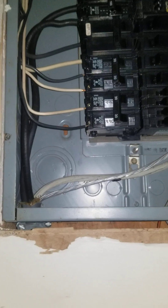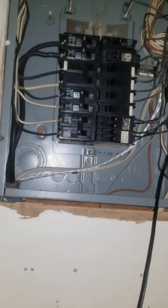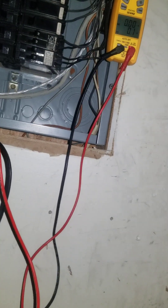More importantly, if anyone would come up here to make sure this box is grounded — the box must be grounded in case something happens where you have a fault. You do have enough space here, which is 36 inches in front. But regardless, you don't want to come in, maybe get something from this shelf, accidentally touch this energized box, and then you're out here barefooted, touch this door handle, and it goes into the ground. You become a grounding path.